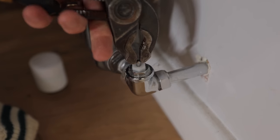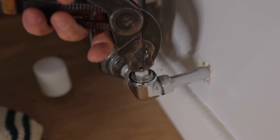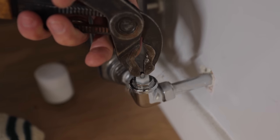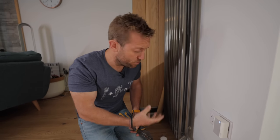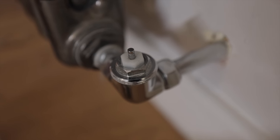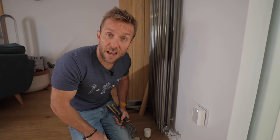So do not hit it with a hammer. Instead, grab the TRV pin with a set of grips and just start wiggling it. They're usually in a locked position — just give it a nice little pull, loosen it off and get it moving. Once you've done that, give it a spray with WD-40 to lubricate it. Then throughout the summer when these are generally shut, open them once a month so they don't get stuck again.